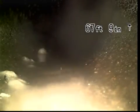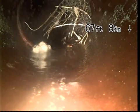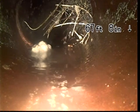Okay. Now, from the middle of the street back to the property and in about 10 feet, this section of pipe eventually will be replaced by the city or a contractor hired by them. This is called the lateral. So the roots are right there. See how they're growing into the joint? It'll be renewed by the city.